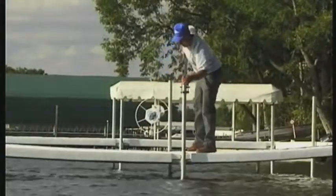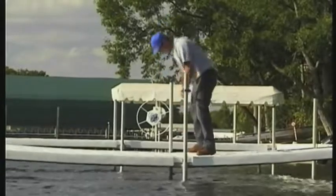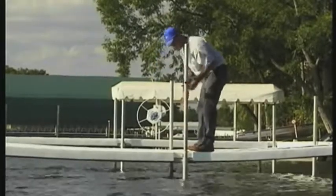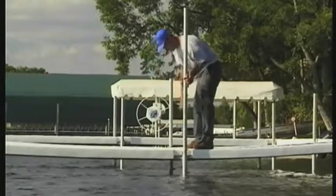The high tensile strength pipe allows a large amount of flex when forcing pressure on the middle of the frame 8 feet back from the barrel support. After pushing down on the removal jack multiple times, pull back on the pipe to bind it so it does not pop up between resetting for another push.